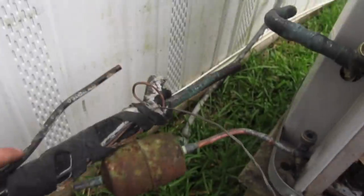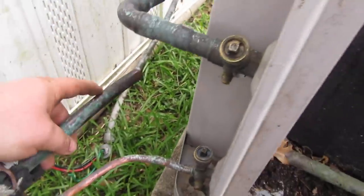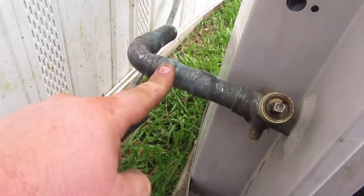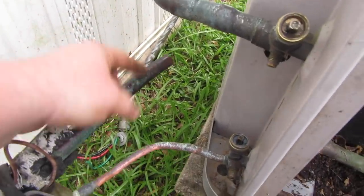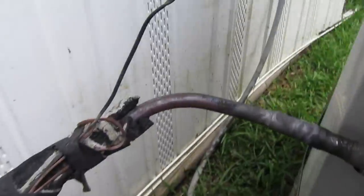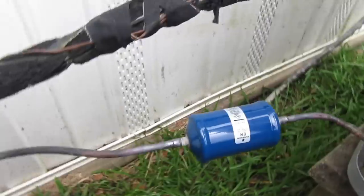We're on the job site. We've got the Carrier Tech in place. There's the old Nordine. I'm going to cut that old dryer out, put a new one, take my bender, bend a 90. It's three-quarter copper with a 7/8, so I'm going to unbraze this 90 and stick the three-quarter inside that piece of 7/8. The brazing's done - I took the Hilmor bender and bent a 90, and I was able to bend the rest by hand. We have a new dryer in place.